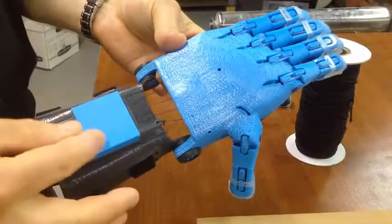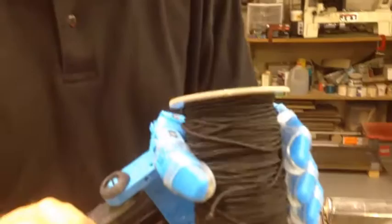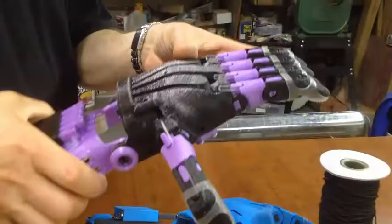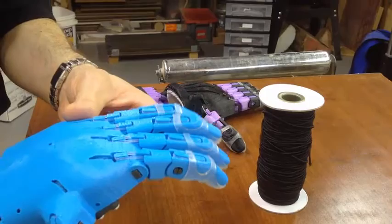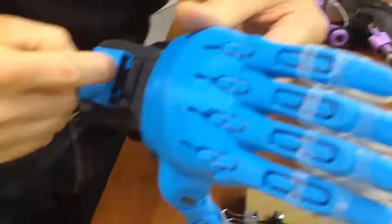That's because all of the fingers and thumb are being pulled equally by the tensioner block. If we look at the modified version, the Gripper Box — when I pick up the same reel of elastic and grip it, you will see that every finger is now cooperating and taking part in that grip. The Gripper Box is distributing the force among the fingers, rather than the more traditional tensioner where the first finger to hit an obstacle stops all of the fingers moving. With the Gripper Box, it distributes the load, so when more than one finger hits an obstruction, the other fingers carry on moving.